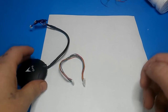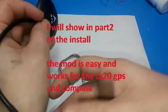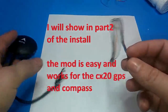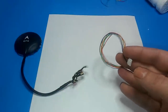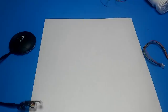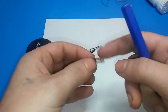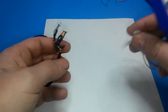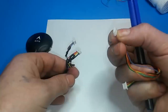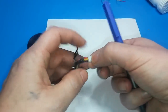For GPS, I'd suggest ordering a GPS module for this unit because it comes with a plug-and-play cable. It's just a couple of wires anyway so it's really up to you. In all my videos I draw out the pinouts because these GPS units come with different wiring schemes or color codes — the pinouts are the same, it's just the colors that differ. I've also really mangled my wires; I prefer this new clip style where you can hold the end and push down a clip to remove it, instead of yanking on the wires.